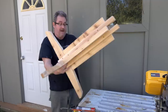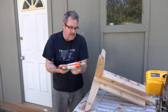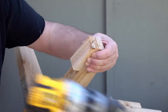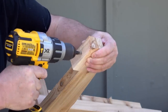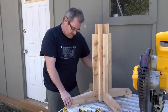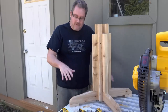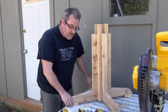There's one more thing I need to do with the legs on the bottom, and that's to add these blocks on the end here. I'll get a liberal amount of glue on there and then drive a two inch screw right in the middle to fasten it in place — making sure I drill a pilot hole first so the block doesn't split. What those feet do is keep the base up off the ground or deck so water can drain away. It also helps to level it — you can actually plane this down to make it sit more flat on your deck or patio.